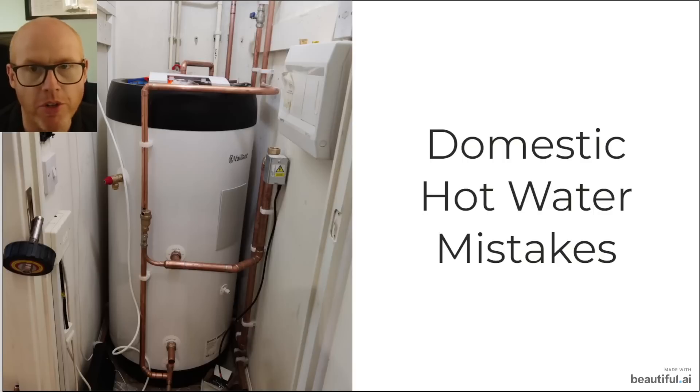In this video I'm going to talk you through a few things I wish I'd known about heat pumps and hot water storage in my house before I'd gone ahead and agreed on the design and the installation. Some mistakes were made but it wasn't the end of the world. I'm going to walk you through some of my experience so you can get a better understanding of what you need to know about hot water when it comes to heat pumps.